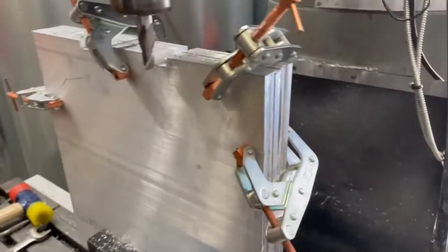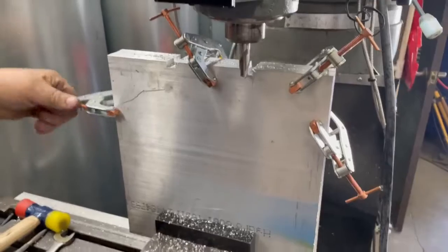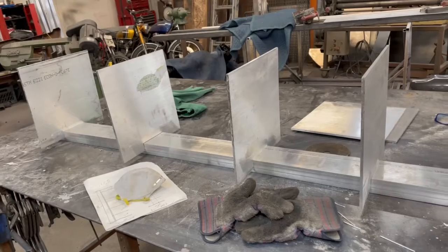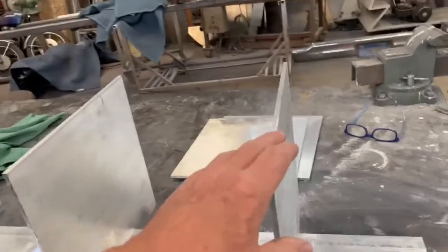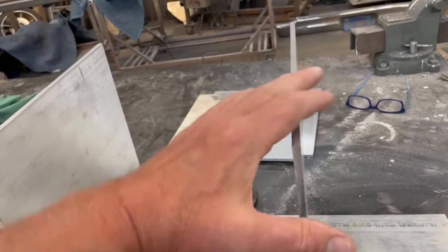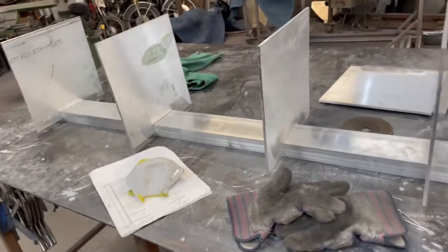I got the shelf parts in the mill — milling out the back of this shelf just to get it closer to the wall. All the pieces are cut and notched, they fit together. Now I need to radius these edges. He doesn't like the crisp edge — I personally like crisp — but he likes a radius edge. I do another table for him called the Thin Line and that edge has a radius to it, so you'll see that. Then I'm going to sand it all smooth — it's easier to sand now when it's all apart.